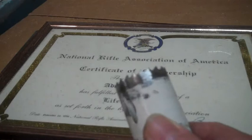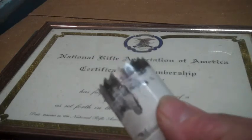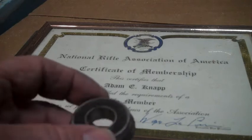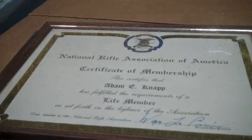Okay, Bob, in order to turn a hole that's tight enough to hold this bearing, or a pair of these bearings, that's going to center everything, I ground the teeth off the outside of this bit. It's a 1 3/8, so if you so desire, you'll be buying me a new bit. Later.